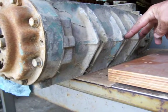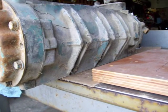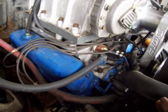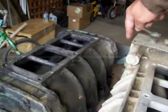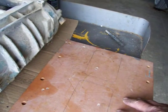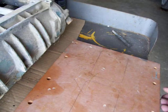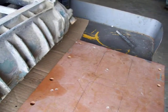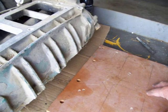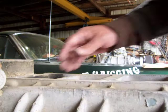It just has two tie-down points here. He's gonna put it on a 440 Mopar engine, and I think the first thing I'd do is find an intake manifold. More than likely whatever intake manifold you find is gonna have a bolt pattern for the 6-71, and then you're probably gonna have to make a template and do an adapter plate — minimum a half inch thick, maybe a little bit thicker. It could be done out of aluminum, or you can buy them.